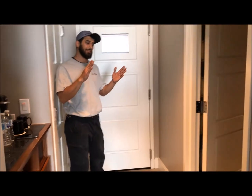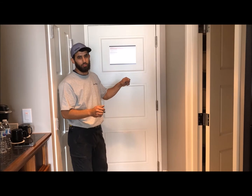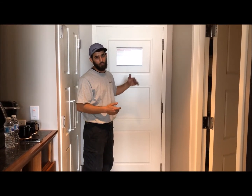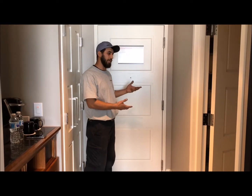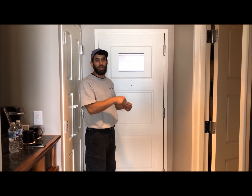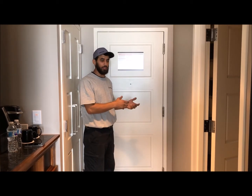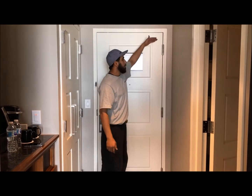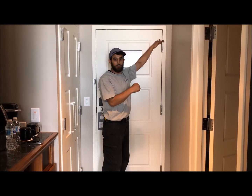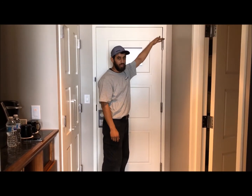Now every door is a little bit different based on how you've installed it. You may realize if it has a little bit of bind and you cannot fix it, you may have to adjust the pressure just a little bit to help close that. Our last door was 5, 4, 4, but again, you may realize everyone is slightly different. You don't want to go all the way to 7, that way you have that little bit of room if you have to adjust it. The top is the adjustment for the spring that has the adjustment from 0 to 7. Again, this situation we use 5.